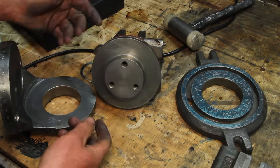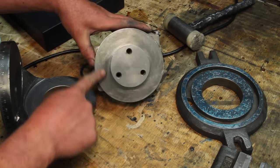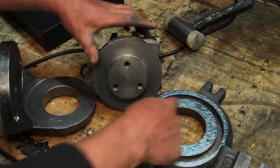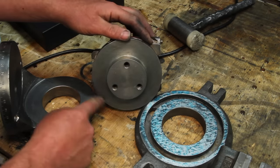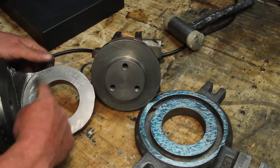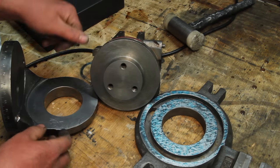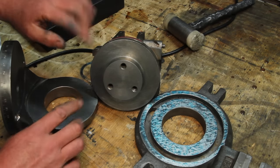For these two pieces, it's a little trickier. I can't really print this off the surface plate. I did sort of check this off of this piece, but I can't get the whole way out. Kind of blued this up a little bit, checked here. Did a little very cursory scraping, but for what it is and my appetite for doing more scraping, I'm calling that good as is.